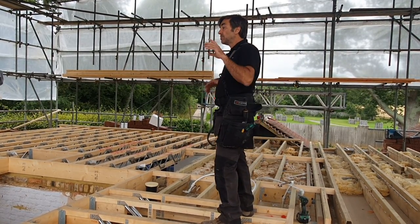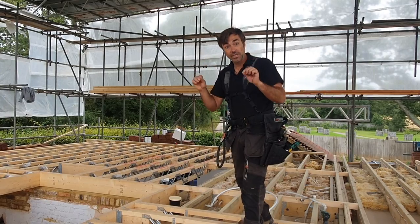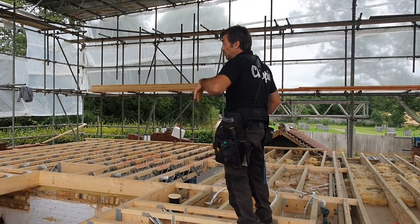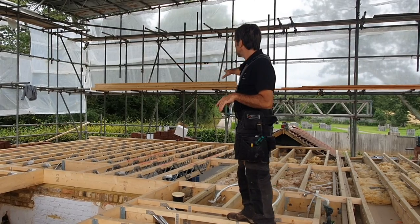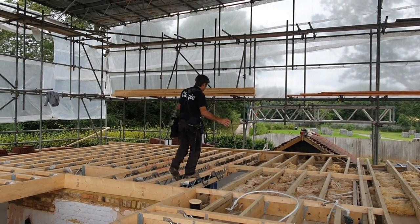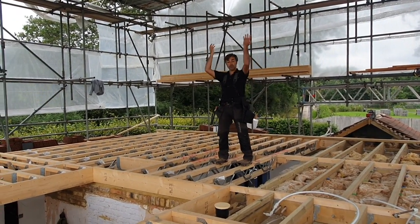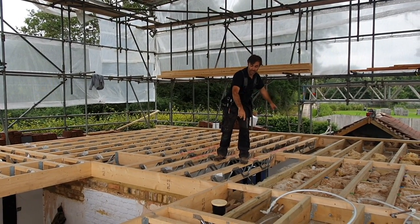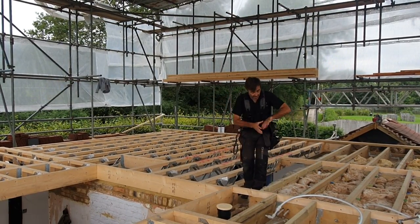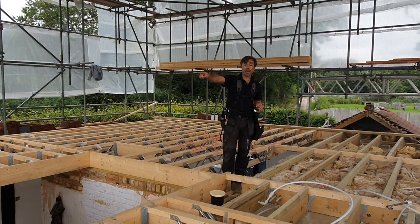We've got four floors effectively. We've got the new extension over there — a bathroom — and you can use this product in a bathroom, tiled on top, no need to ply it. We've got this main bedroom floor which comes around the stairwell, then the upstairs study floor, and then another bedroom. The reason we can't floor all the way through is that my roof structure relies on some quite heavy trusses which pick up my ridges and go right down onto the wall beneath, so the floor comes in either side.